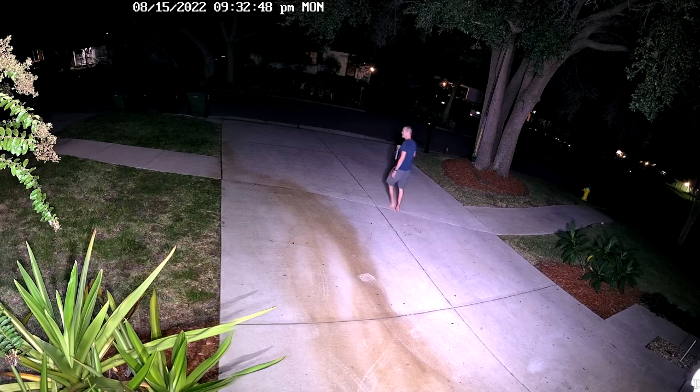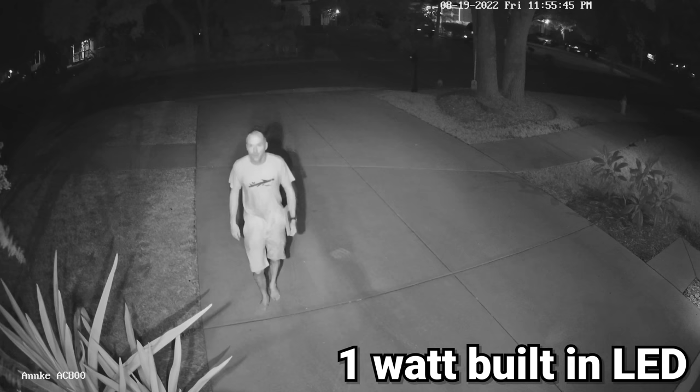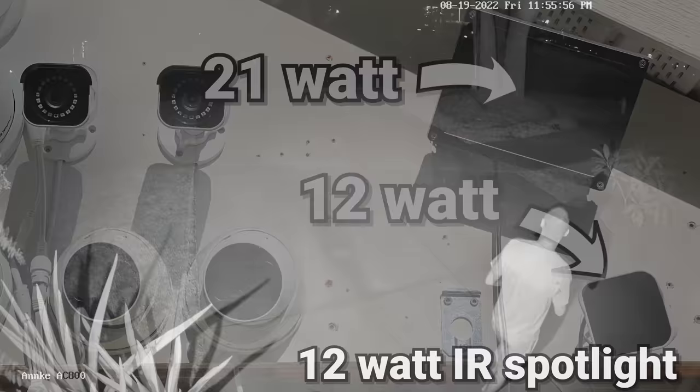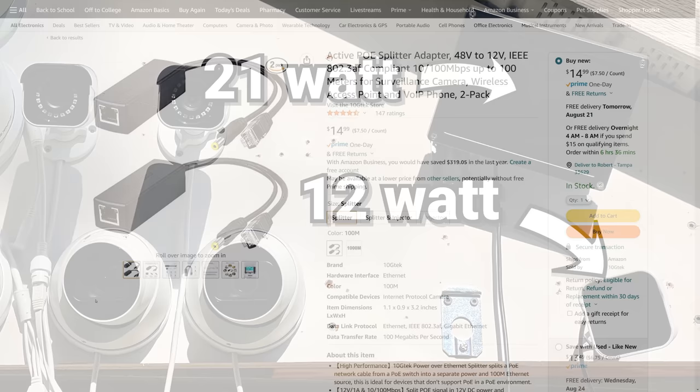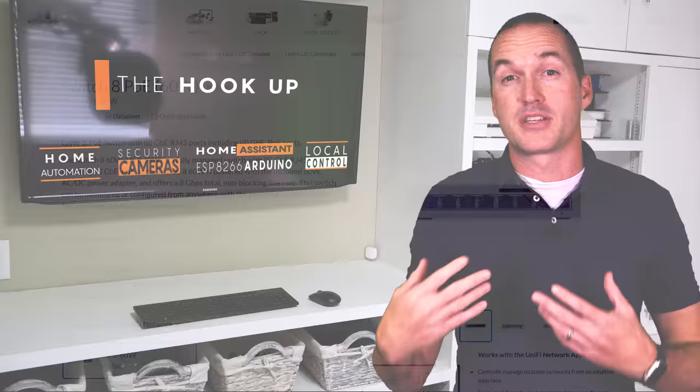You probably know that you can buy a floodlight with a motion sensor, and in addition to providing more light for a better security camera color image, they also help deter criminal activity which tends to take place in poorly lit areas. The only issue is that your neighbors might not want an extremely bright light coming on throughout the night, and the extra light is only as effective as the motion sensor that activates it. But did you know that infrared floodlights exist? Typical security cameras come with less than 1 watt of infrared LEDs, which is better than nothing, but ultimately isn't that much light. You can buy IR illuminators in different sizes like these 12 and 21 watt units from Tendalux, and if you already have a camera running over Power over Ethernet, you can get a 12V PoE power splitter and a 12V barrel jack splitter to run your camera and your floodlights on the same PoE connection. You do need to be aware that your PoE switch or NVR needs to be able to support that extra wattage.